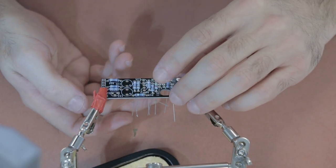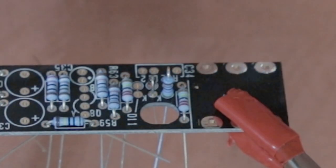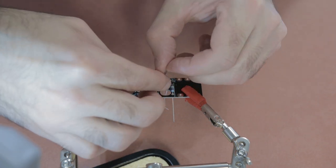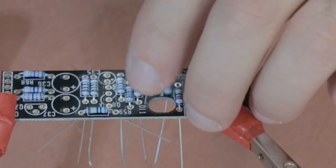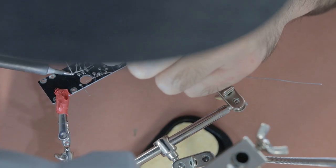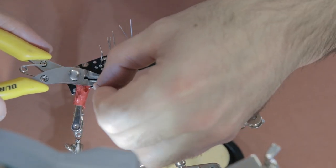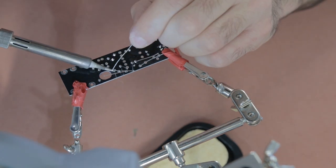I use a little Allen key to hook the leg over and bend it nice and neat. Then it's onto the diodes — there are a couple of diodes and remember they're polarized. Make sure the little black line lines up at the top, and the red part of the body goes down into the circle part of the circuit board. Hook over the leg with the black line and leave the red body leg straight. Once those are in place, flip the board and start soldering — start from the outside, working to components easiest to reach, snipping legs as needed.